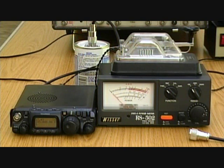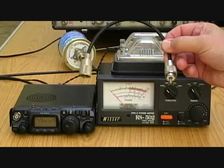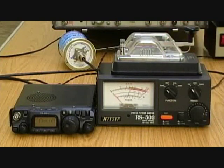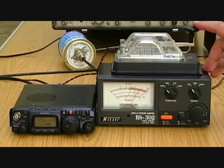What we're going to do now is introduce a length of coax which we've measured as 12.5 metres. Not a long length, but enough to show us there are some losses in the cables. We've now connected in the 12.5m length of coax — that replaces the short patch lead between the transceiver and the power meter, so you've now got 12.5m of the same RG58 coax. We're set to 3.5MHz again — last time it was about 3.5W — and it's still 3.5W.